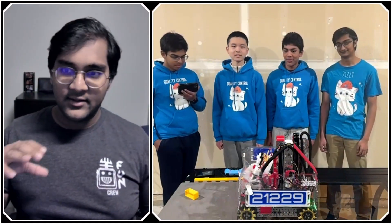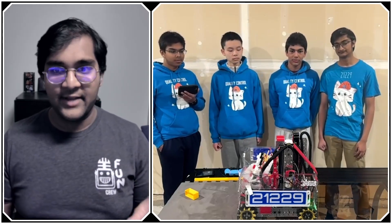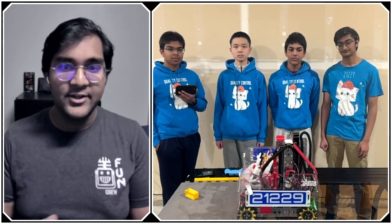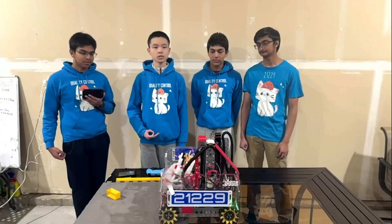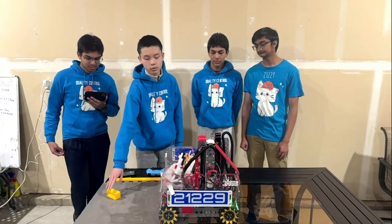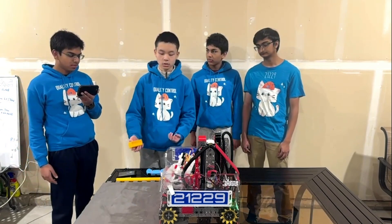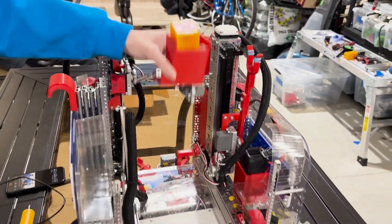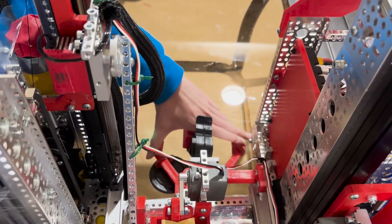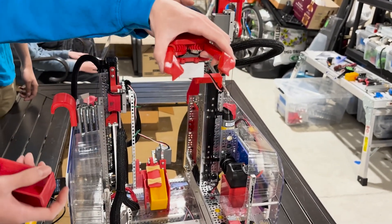The main overall architecture question is the dual intake-outtake design. You guys have done this design a lot of times before and also explored a single intake-outtake. Why did you specifically go with the dual architecture? We realized it was important to be able to both score sample and specimen really quickly. We needed to intake a sample from one side of the robot and score at the other side. The same thing needed to happen for specimen. So we decided two separate subsystems would work best — an intake that transfers to an outtake scoring at the back for samples, while something that intakes specimen from the back and scores in front would minimize robot turning and make driving from intaking to scoring as smooth as possible.